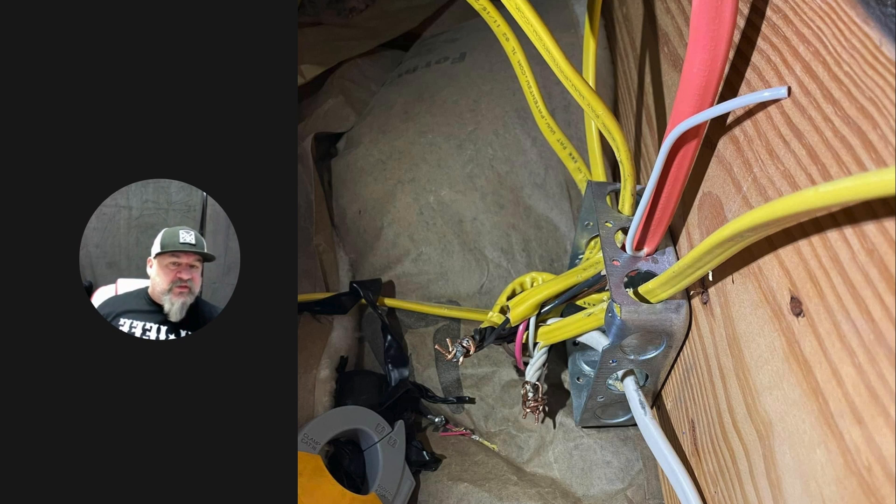Take a good look at this one. I don't know what that bigger wire is — being a colorblind electrician, I'm going to say pink or red. Yes, I am colorblind. But look at all those wires twisted together — that's all one circuit. How do you even get a wire nut on that? I've seen this so many times, and never mind the connectors — somebody just slopped it together. And I can see that it's in an attic.